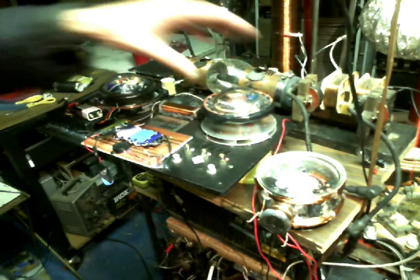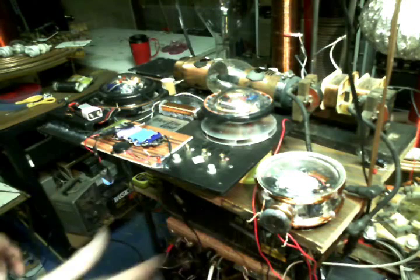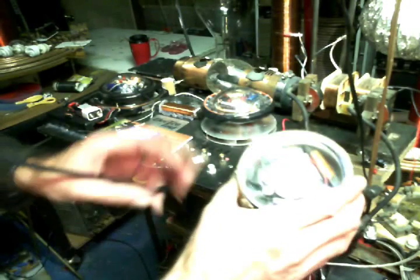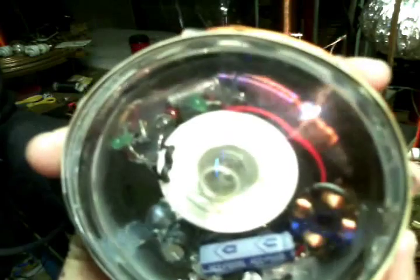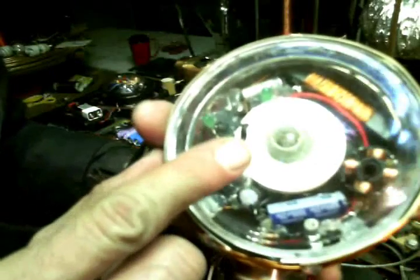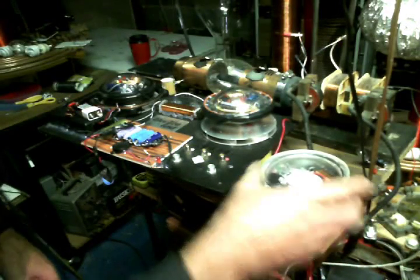What I'm attempting to do is get these three transmitters to sync with one another — I'll explain all the details on that later. Essentially each transmitter is built with LEDs, a coil of wire on some laminate for the antenna, a fluorescent bulb starter, and a piezoelectric buzzer, so this too will have an annoying beep.